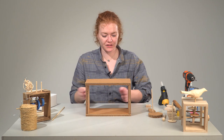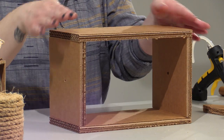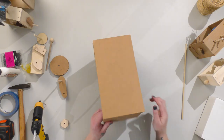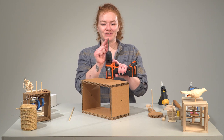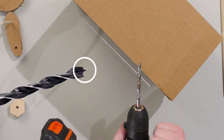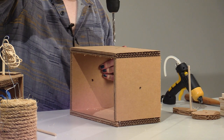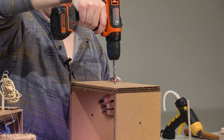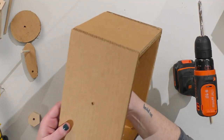There's our cardboard box. In this case, I used very thick cardboard that has multiple layers of cardboard glued onto each other, so it's really thick and I don't really need any extra supports. What I do need to do is drill a hole in the top of my box for the cam follower piece. One teacher tip: use a brad-pointed drill bit. A brad-pointed drill bit has a tip and two little wings that are very sharp, and it's going to make a really clean hole in cardboard or in wood. I've got the hole marked in the center and I'm going to hold the drill right up and down and go really slowly and drill all the way through. Then get all the little fuzzy parts out, because those will trip you up later.